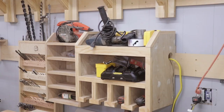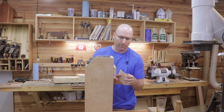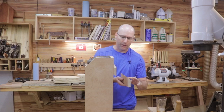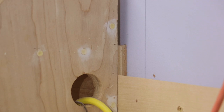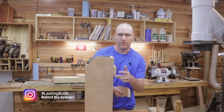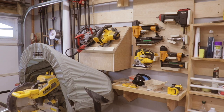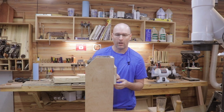Having the two opposing 45 degree angles with a sharp edge certainly makes for a nice tight joint, but it also poses a couple problems. If some dust gets behind the wall cleat and starts to build up behind there, when you go to put your cabinet there, you're not going to get a good snug fit. Secondly, if you make a wall cabinet such as this one and some glue seeps out from underneath and it's still wet, it's possible that you can glue the tip of the wall cleat to the joint of the tool cleat.